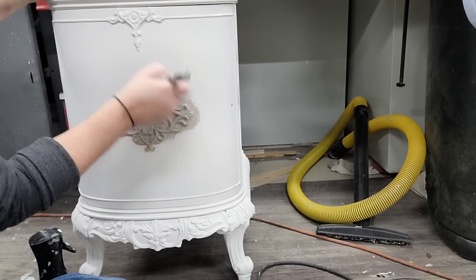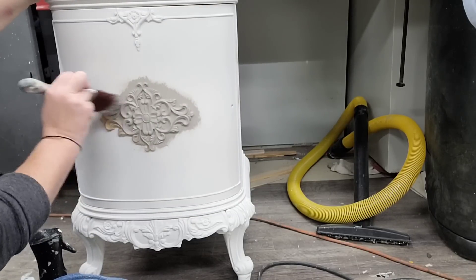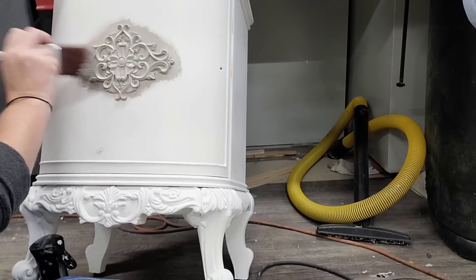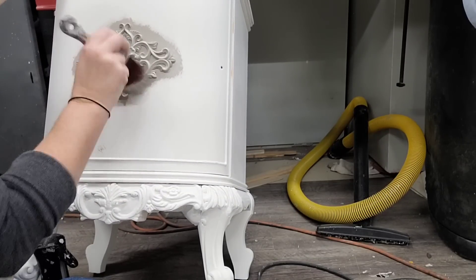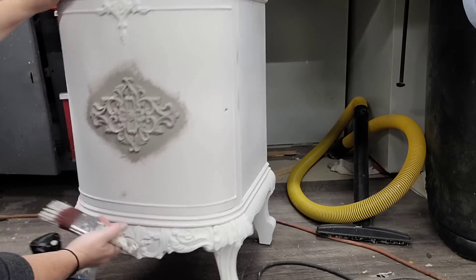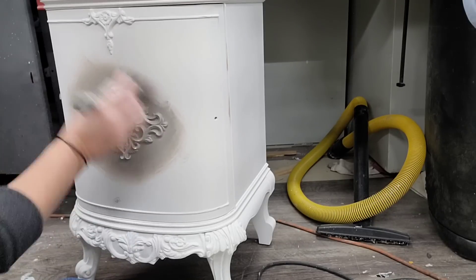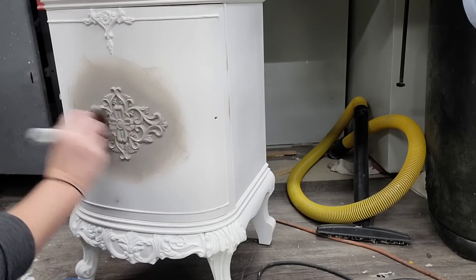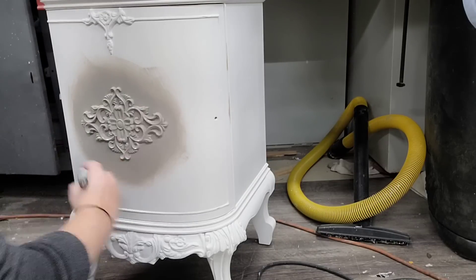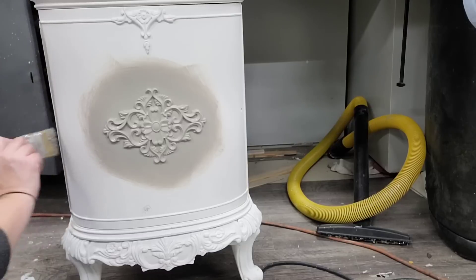Let's go ahead and add some paint to this piece. I'm starting with a coat of French Linen just going over the tops of all my moldings. French Linen is going to be a base color for my metallics — since metallics have less pigment than flat paint, I want to give them a base coat of a similar color for coverage. My body color on this piece is Dixie Belle Fluff, which is a nice rich white that gets great coverage over the white Boss. Then I'm going to blend the French Linen out into the Fluff to create a halo around all the moldings — that's really going to emphasize them.